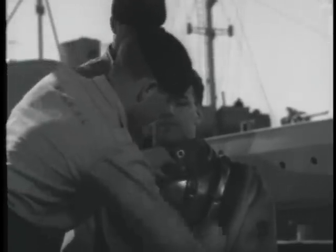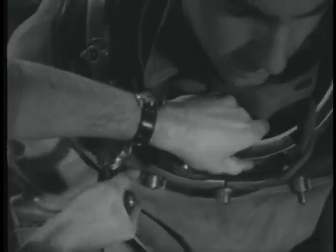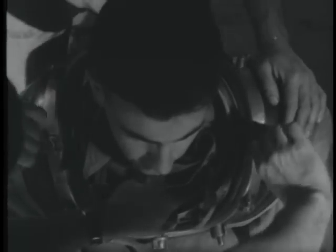Then the wing nuts are tightened by the T-wrench, one tender working from the front, bottom to top, the other from the back, also from bottom to top. This guarantees a secure fit, keeping the collar from wrinkling. Care must be taken not to use too much force or the studs may be pulled out. The flange wing nuts at the joint are now set up. First the front, then the back, then the two sides, each tender taking the appropriate one.